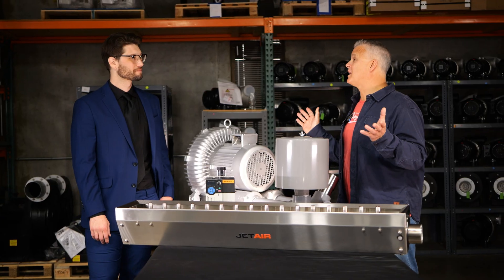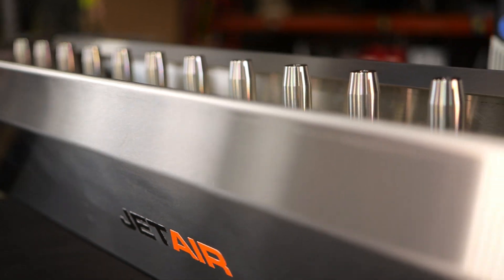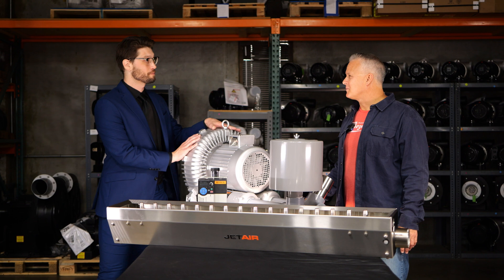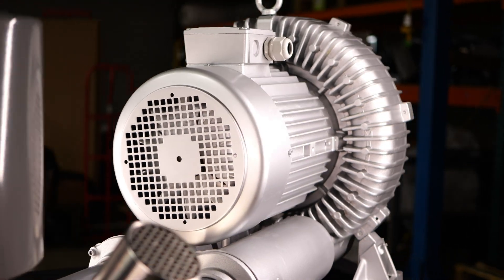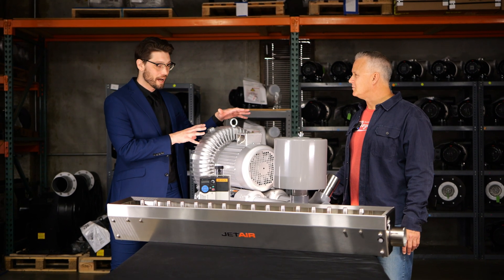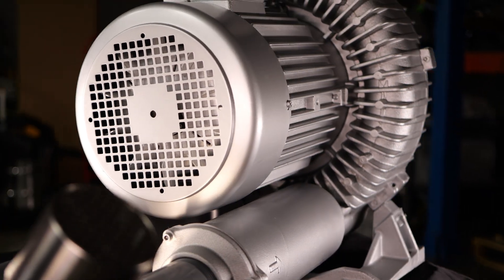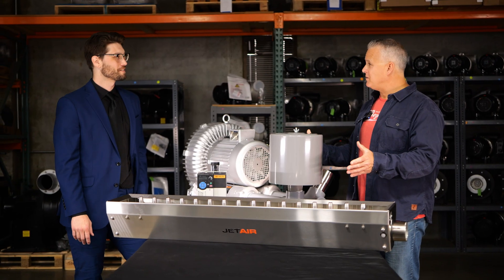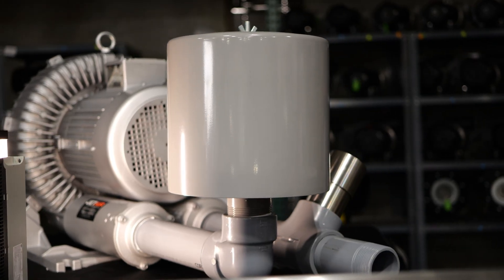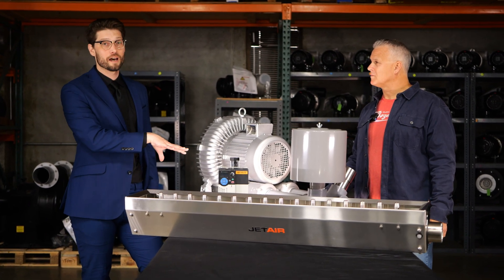This is a Share and Ship and we've been talking about everything but what's on the table. Let's talk about what's on the table. So, again, this is our Ion Rinse Starter Kit and we'll start at the back here. This is a regenerative blower — it's not like our typical centrifugals that we use for the CPG market. This is actually going to be a higher pressure profile than the centrifugals, so this has more pressure, it's generating more pressure. This right here is filtration. Plants can have some sticky air sometimes, and we want to make sure we're getting cleaner air into your containers. Our Ion 3 actually has dual filtration, and that can be adapted to this as well.